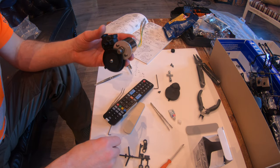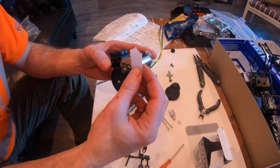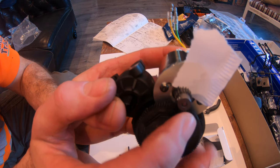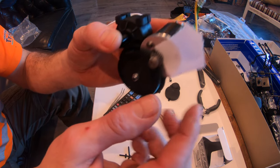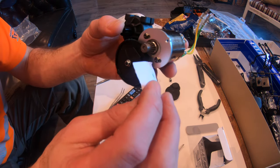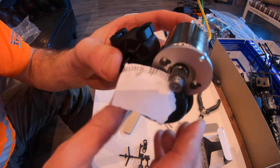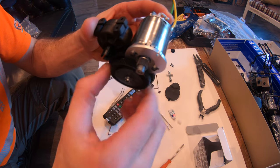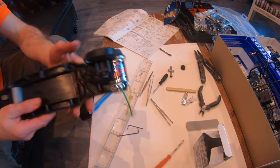Quick update on setting the motor and pinion: I've set the pinion on and used a piece of paper between the motor and the pinion so it's not quite touching the plate. I pushed it on and tightened up the grub screw to set the pinion to the flywheel. I used the piece of paper and tightened down these screws so that should be enough distance. I'm going to add some ceramic grease now.